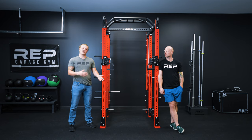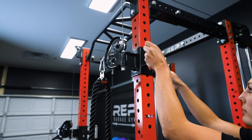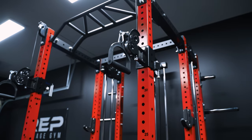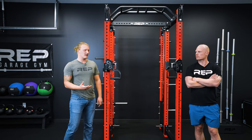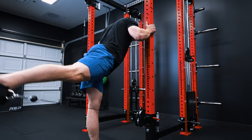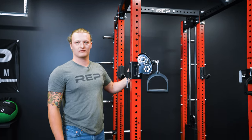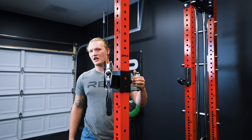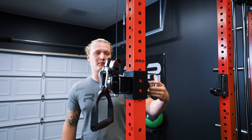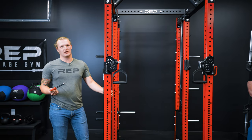Let's talk about the overall design and engineering of the Athena, starting with the trolleys. These are the exact same trolleys used on the Ares. We had a goal to make them light and smooth so they're easy to move with one hand, yet strong enough to handle heavy weight stacks. We added cutouts to reduce overall weight and enhance visual appeal so you can see the pulleys in action, then added plastic liners for the least friction possible on the uprights. We also added a knurled handle and an oversized pop pin for a secure grip. The sleeve of the pop pin is machined so it has a smooth and satisfying feel as you pull and release it, and we added an extra security pin for safety.